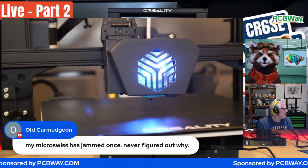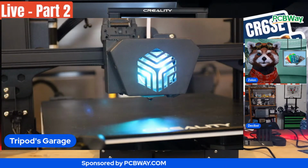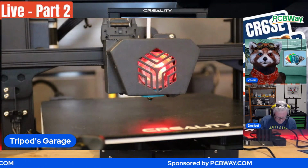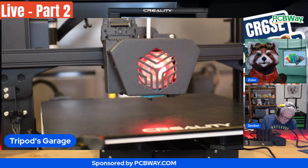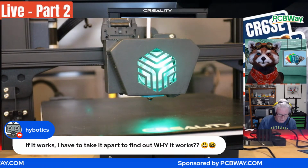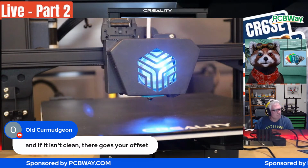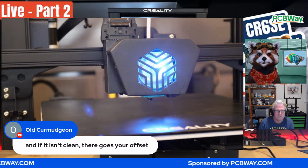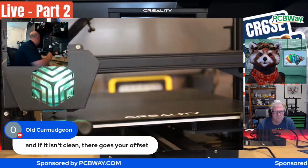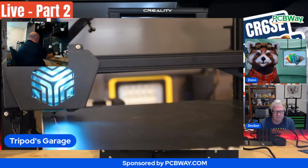Yeah. Like I said, it wasn't the hardened steel; it was a steel coated nozzle by default, I think what comes with the Swiss hot end. Yeah, so it comes with a coated one, a wear resistant nozzle, as they call it. Yep, correct. I also got them to ship a couple more of the nozzles with it, because I've got a whole stash of Creality nozzles. They seem to be fairly good as long as you don't put anything abrasive through them. I've only thrown out 2 in 10 months. That's not bad. I've only gone through 2 nozzles in 10 months, on my 3rd nozzle with wear, so that's not too bad. Oh, I didn't clean the bed. We'll see what happens.